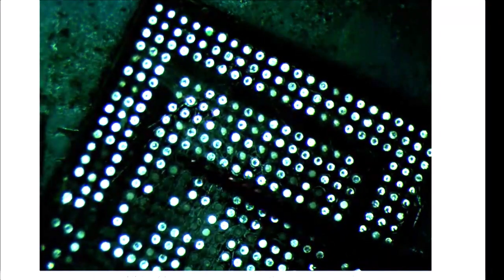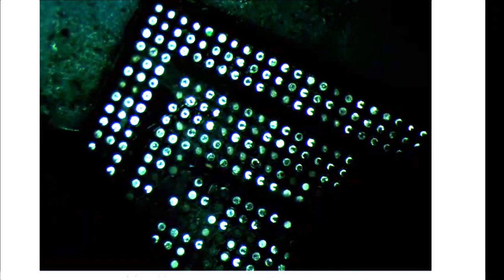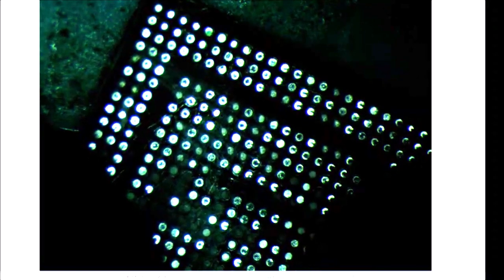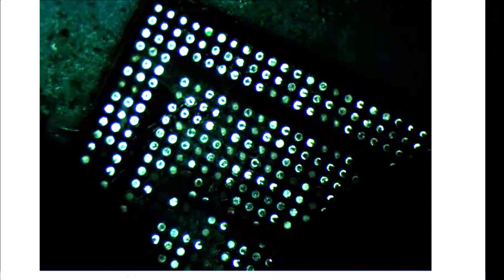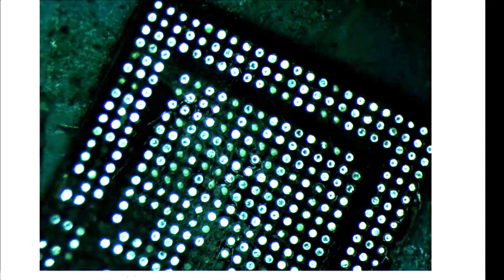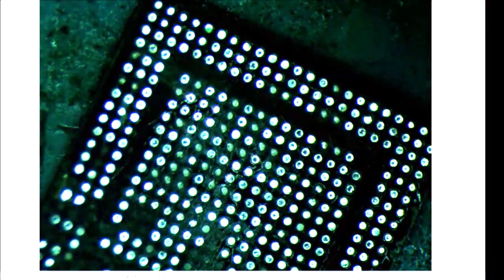I don't know what is going on with each of these pads. It looks like I literally have to scrape this oxidation off of every one that looks dark because I can't seem to get them to take solder. What a pain in my behind. Well, this is a lot of film, so I am just gonna cut and put the cameras back on when I get this guy reballed and ready.